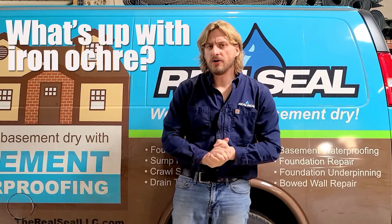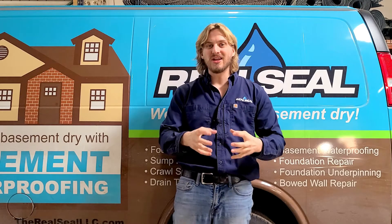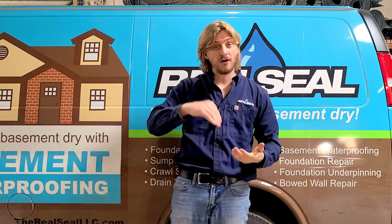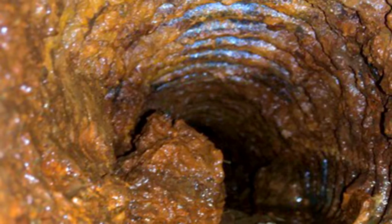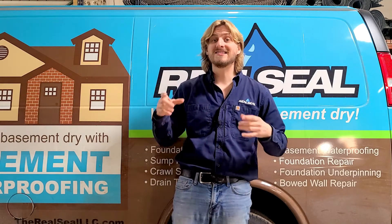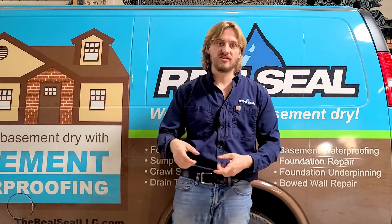What is iron ochre, and how do I know if I have it, and why is this significant? Iron ochre is a bacteria that grows underneath the home in the dirt and in drain tile systems. It looks like blood orange lava, and it builds up — similar to a waterfall freezing over — as it comes into your sump pit, and it clogs the system. There's no getting rid of iron ochre, which is why it's such a big problem. To manage it, we have to install clean outs and a solid sewer pipe system, and then do monthly maintenance by dropping bleach tablets down into the system. You'll need a variance from the village if you don't live in the city of Chicago in order to tie that into the sewer system, since you don't want bleach and iron ochre going into your yard.